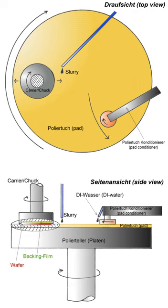Next, the etching process is used to etch the wafer and leave a small amount of oxide in the active areas. In the end, CMP is used to polish the silicon oxide overburden with an oxide on the active area.